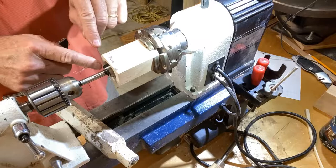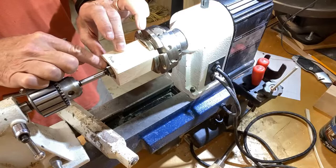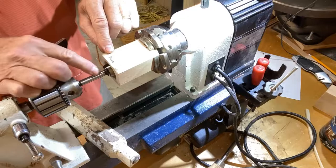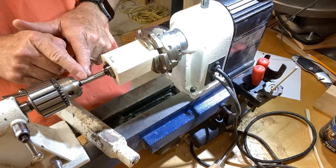I've made the relief cuts on both the cap end and the plug end. It's very important to do your relief cuts first before you do your center hole cut. The reason for that is that your Forstner bit has a little tip on the front, and that tip needs to grab hold of the wood before it can cut. So if you make that center hole cut first, when you try to make your relief cuts the Forstner bits won't have any wood to grab hold of, and they'll make it very difficult to get a clean cutout.